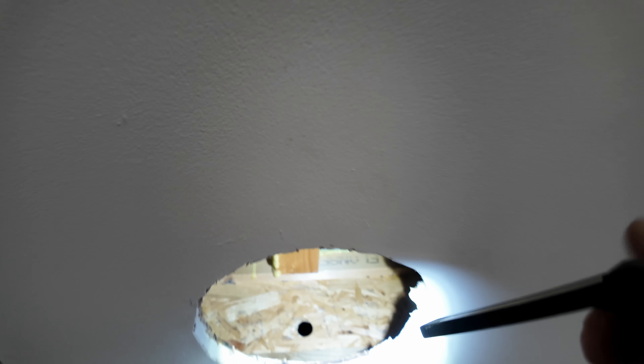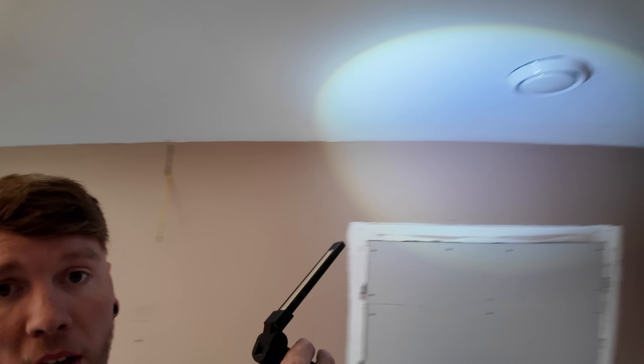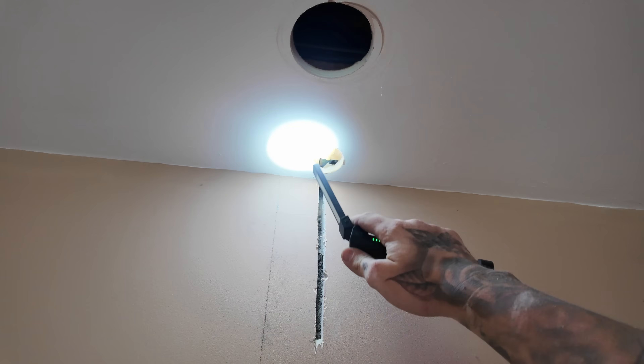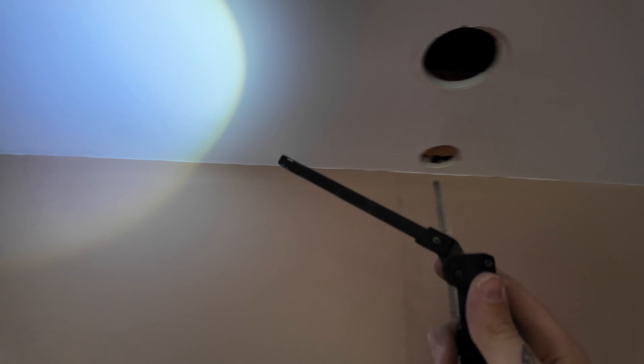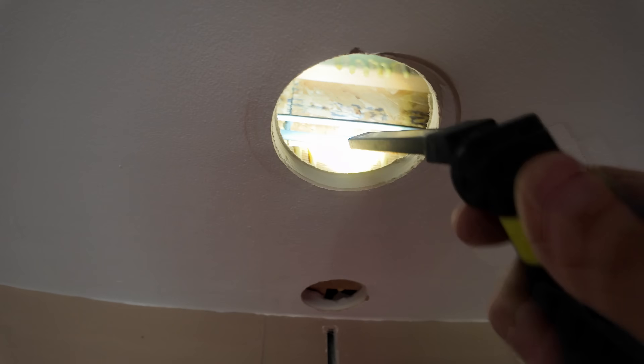Last but not least, what I'm doing now is drilling through all the joists. Unfortunately I'm having to blind drill a few of them, but I sort of know where the pipes are - you can see the pipes here and we've got an extractor fan over there. So I'm drilling these ones and we're feeding all the way back, then I'm going to try and pull some cables in today, because time has run away with me and I'm only here for two days - just staying in a hotel around the corner. Here we have hit the jackpot - a tee piece between two joists. I drilled it at the right angle to check there was nothing coming up. My extender bit is long enough to go through both joists and we'll just have to do a fish up and over. I only hit the camera three times but we're through - there's no water, power's still on.